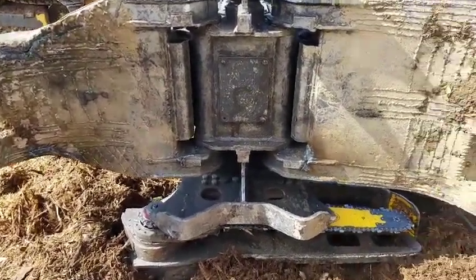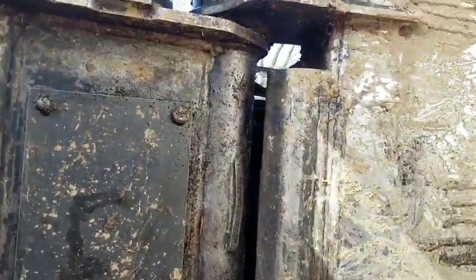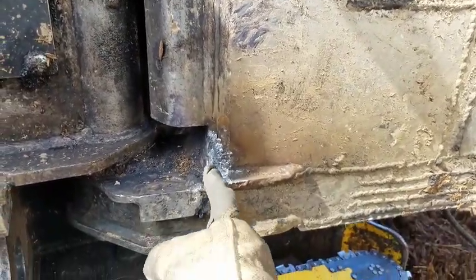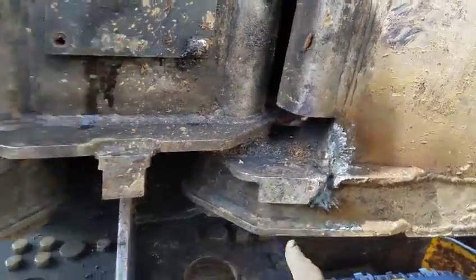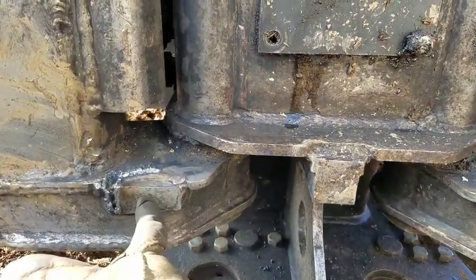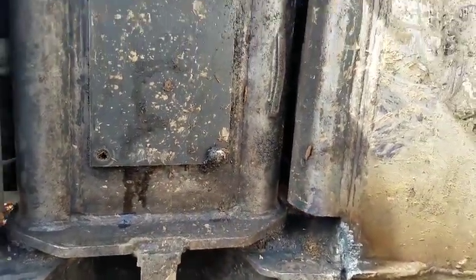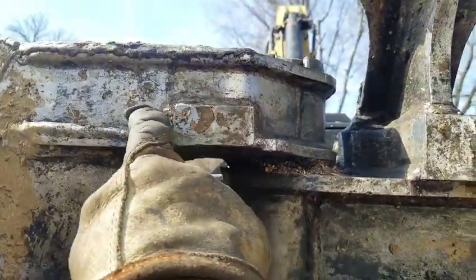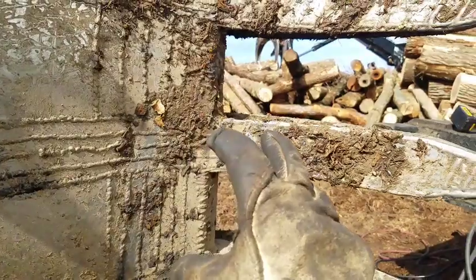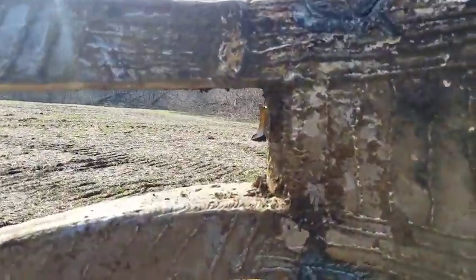All right, we're rained out trying to do some improvements on this thing. It's starting to crack around and this ain't the first time it's cracked. I took the gouger — there's a crack running right down through here, and a crack running right through here. I think that's coming from these blocks that's banging on here when we're closing and opening. That's what that's from. Taylor's already welded this one up once before. Over here them fingers seem to be doing pretty good, but these over here has been a battle — the little two-tongers.